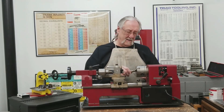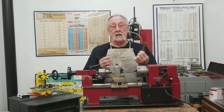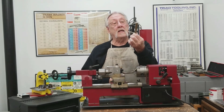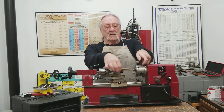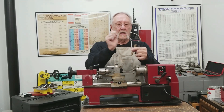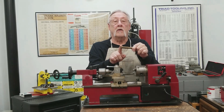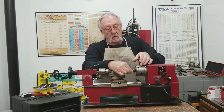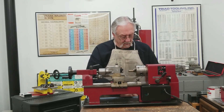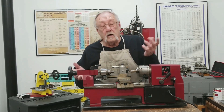A friend of mine calls me the other day. It turns out he would like me to make a small brass bushing. I told him I don't have any brass, but he gives me this. This piece of material isn't the best — it looks like it used to be used as a drift, and I'm not even sure it's brass. But anyway, there's enough material here to cut it down and make what he's asking. I'll put this in here and start turning it. I took a small cut on this and it appears to be brass.